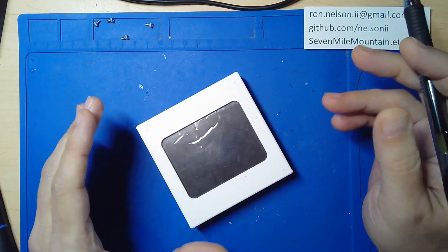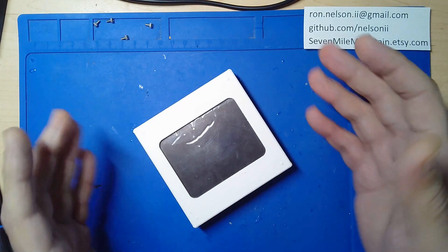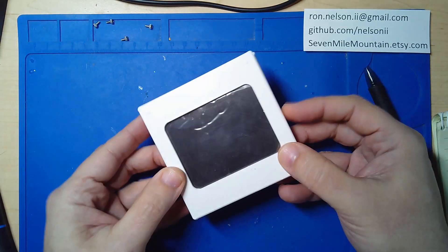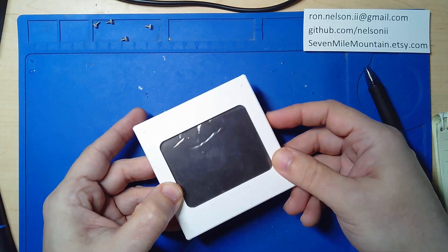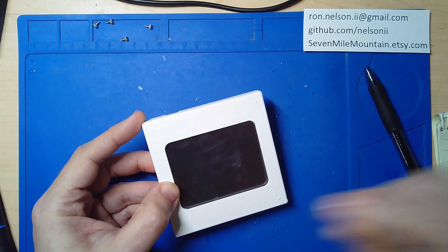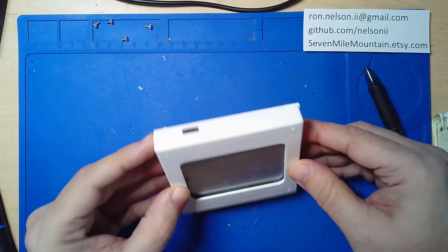So there are pros and cons. It's an older technology, but still very useful for certain use cases. I decided to take this and turn it into something that looks nice — or at least I think it looks nice. This is a 3.7 inch resistive touch screen that I've made an enclosure for. It includes the sensor itself, a controller board, and a QT Py inside that handles computer communication through USB-C.